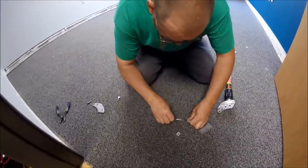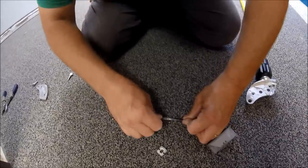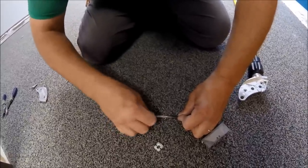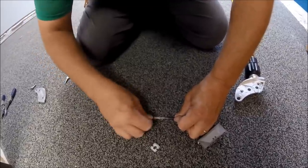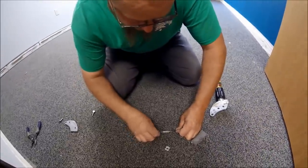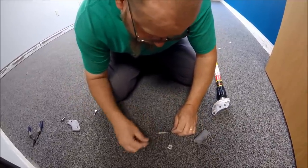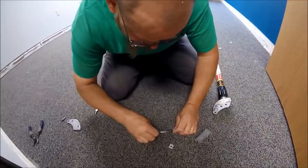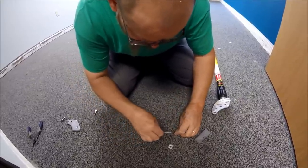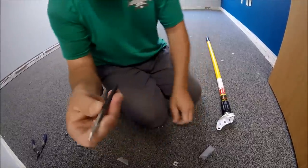This is going to allow your blade to fit in there nice and secure like it should. Just be careful not to cut yourself. It's all glue and stuff from the backing of the carpet that gets in there, so each time you change your blade you need to get that stuff out. Be real careful that your blade don't slip and you get yourself, or that you don't bump into this point right here because it's kind of short from grinding on the concrete. Just take your time at this point. Make sure it's going to slide in and out of there all nicely. Now you can see the difference in that — that's how it should be when you put your new blade in.